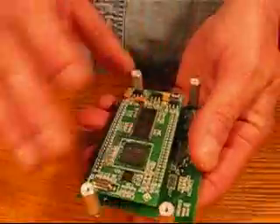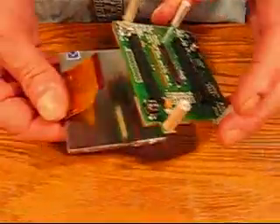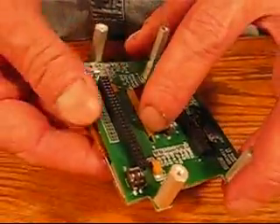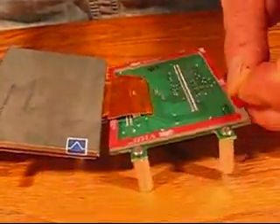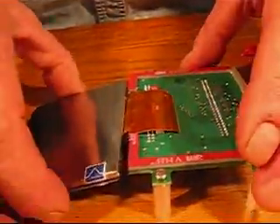To get started, you'll need to remove GEM Express, our universal driver card, from the interface board assembly. Next, insert the data cable into the connector that sits underneath GEM Express. It's a fine pitch connector, so be careful when installing it and locking it down. With the data cable installed, flip the assembly over, removing the protective cover from the assembly tape that's used to adhere the PC board and the LCD module together as one piece.